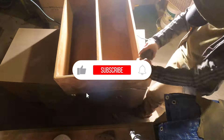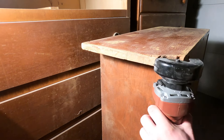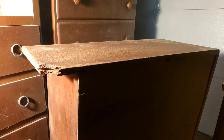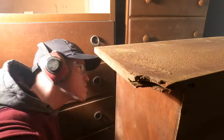But that was going to be a major issue. I've never dealt with something like this before, so it was definitely going to be a challenge. So I started out by sanding the whole shelf down with 180 grit, and then I worked my way to a 320 finish. I just wanted to scuff up all of the wood and get it ready for paint. Then I ended up taking a cutoff wheel where that corner needed to be worked on. My original plan was to take a piece of wood and slide it into a little slit that I created with the cutoff wheel tool.